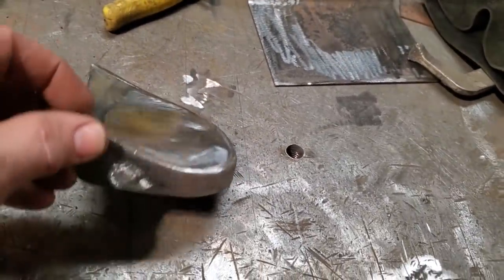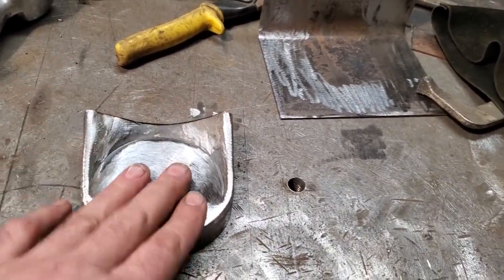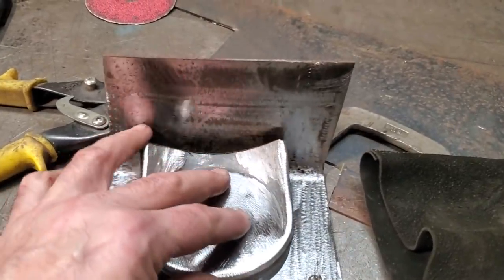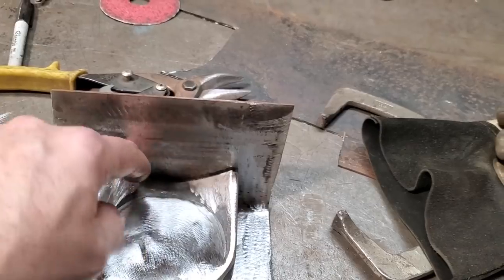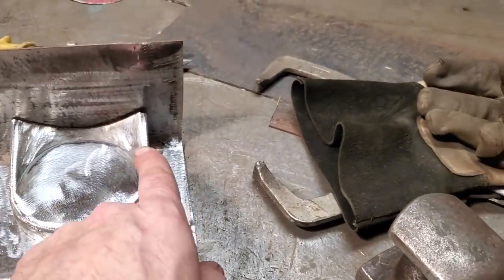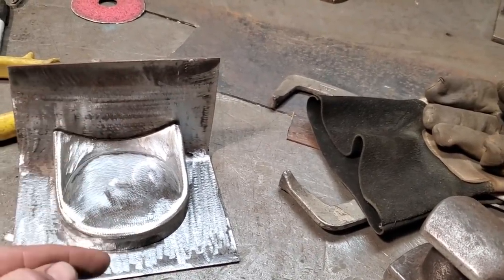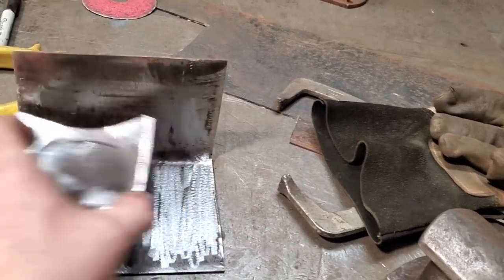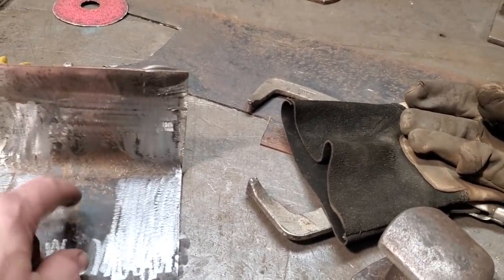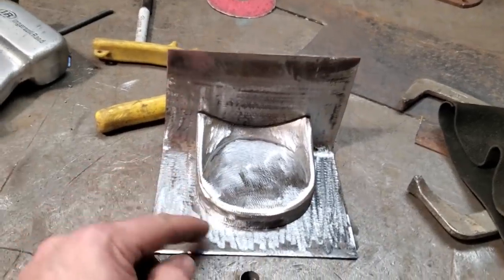Here it is. I'll grind it up and finish it right off, because it'll be too hard to work with later. I can clamp that device and turn it around and clamp everything around it. I had to cut the end off and bevel it out so it'd fit in there nice. That'll sit there and I'll weld that right around and up along and across — weld that permanently. I've got to drill a hole right through the center of this and down through the bottom, then the bottom's got to be cut out. I want a nice round hole because I want to use this to put a dimple in the floor. It's heavier gauge steel and when I hammer into it, it'll come down to meet the hole in the mount. First thing I'm going to do is position that and weld it on.